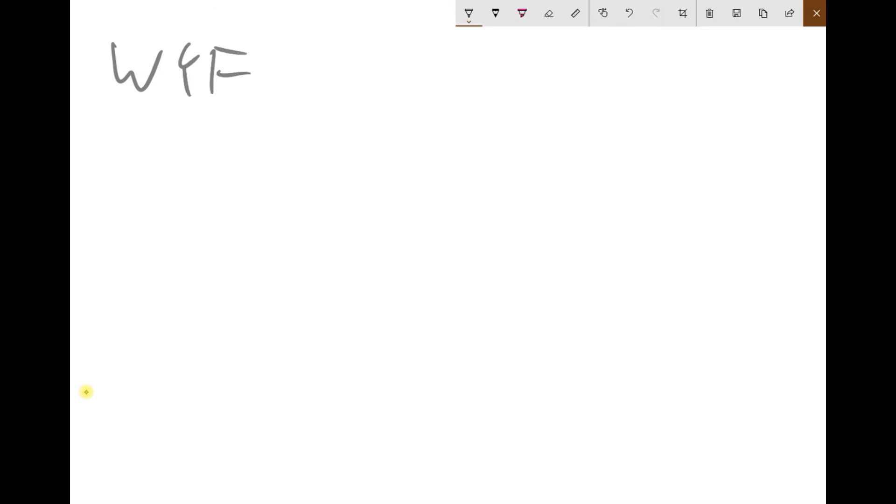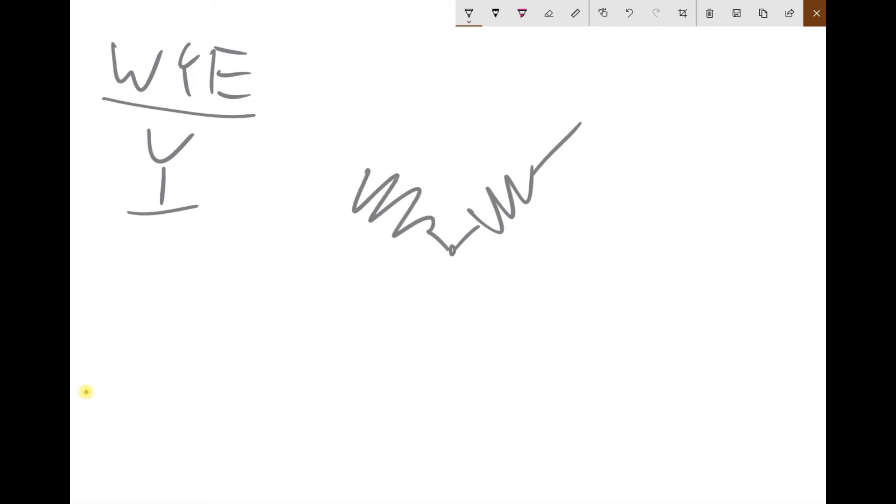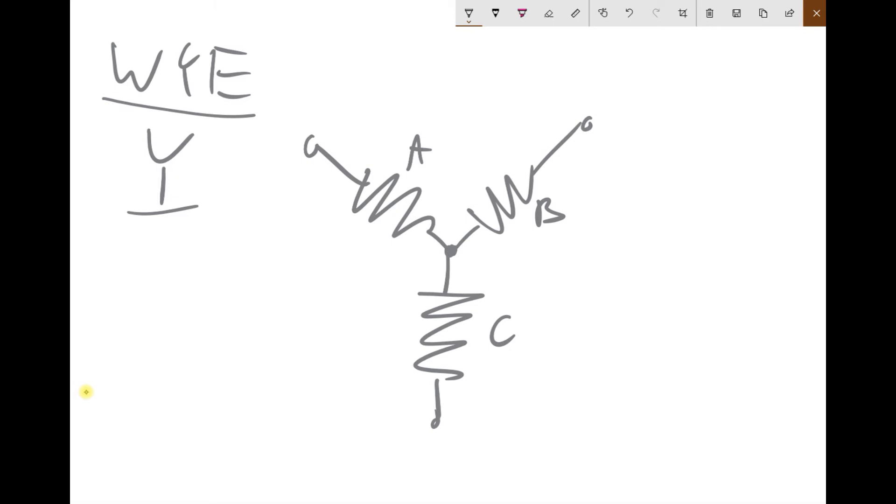One is called Y. The Y termination schema is not very widely used in RC hobby because it creates a slower-rotating motor. Three phases — A, B, C — are connected like this, with one central point, and there is no wire leaving that central point. Wire number one, wire number two, and wire number three — that's all. This is how Y works. You will not see OutRunner motors connected in Y termination very much — I don't think I've ever used anything in Y termination.